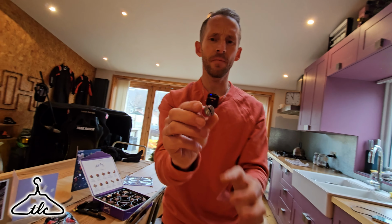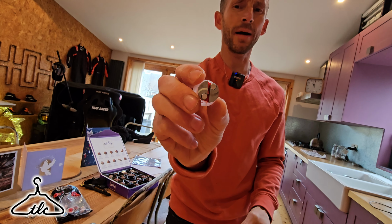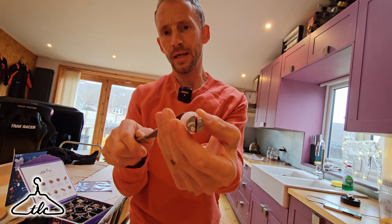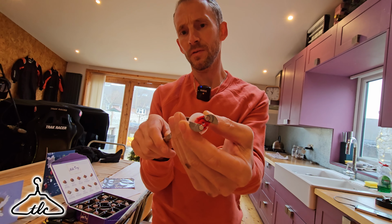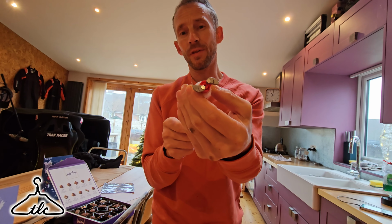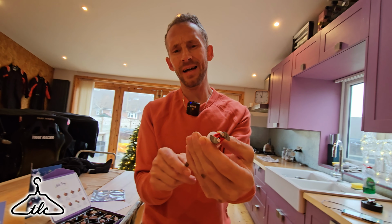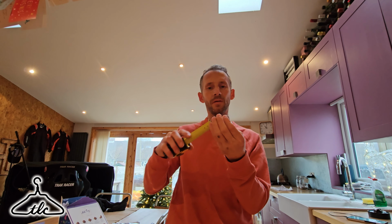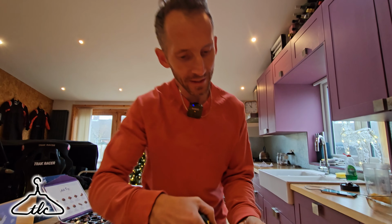They are pretty big, pretty elaborate, and they've got little metal wings at the back. The wings spread out by turning the little screw in the center, like so. And this is why you're going to need a void at the back. Plasterboard is generally 12mm, something like that. So this thickness I'm going to show you right now. These plasterboard fixings, before you push them out, are 15mm.